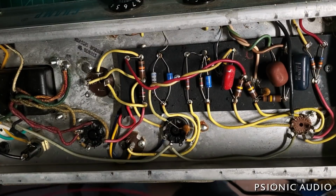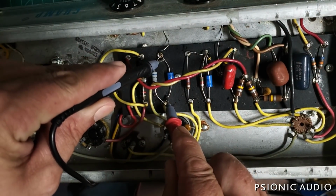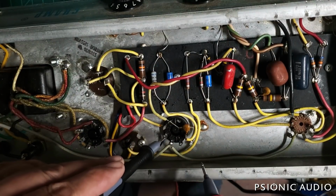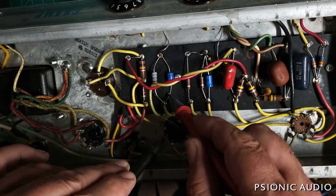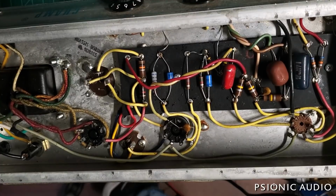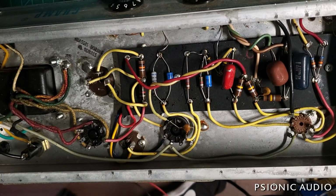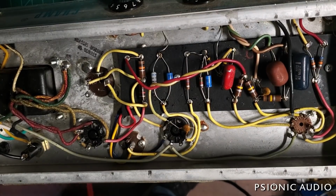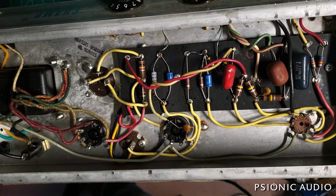All right, new resistor in place, 120 volts mains. Across the cathode, I've got 21 volts, as opposed to 15 something. And plate to cathode, pretty much 400 on the dot. It's fluctuating by half a volt. Which means that this tube is now idling at 11.77 watts, which is pretty much right at the data sheet, 12 watts for a 6V6. So that's pretty much perfect.